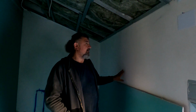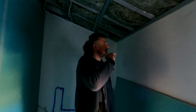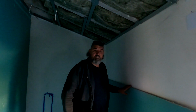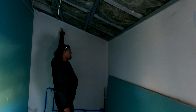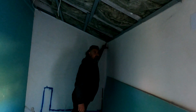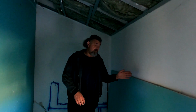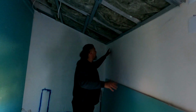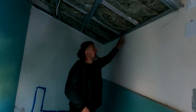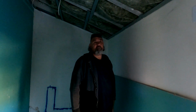We'd attempted to fit this board before we went. We had an hour, and after fitting it we went, oh, well, that isn't fitting at all. It's not even close, even though we've taken all the measurements. We realised what we had to do was cut a piece off one end of the board, which was for here, and not off this end of the board, which is for here, and it's a 5 centimetre difference. The wall is actually out over 120 centimetres by 5. So we cut that and then thought, brilliant, we can go. And then we've discovered that here it's out as well. It goes the other way. So that's turned into a bit of a nightmare.